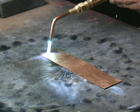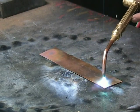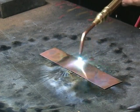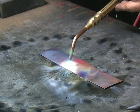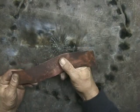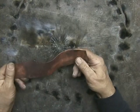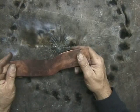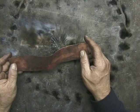This is 16-ounce copper. What I'm going to do is heat this up until it's red hot. If you notice, I play my flame back and forth because I don't want to stay on one spot too long or I'll burn a hole in it, but I do want to get it all red hot. Now that it's cooled, it is just so soft — you can maneuver this in almost any direction. If you wanted to do shapes, you can do that. Just keep working until you get the shape you want. When you feel it starting to get stiff, heat it up to red hot and let it cool. You'll be amazed at all the things you can do with copper.